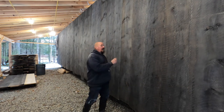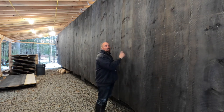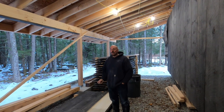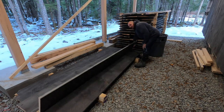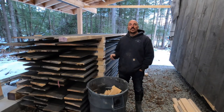After we get the ceiling done in the covered area in the back, we'll add the three-inch battens. If it's a wood product, the most important thing you can possibly do for your siding — to help it last and not cup, warp, break, or split — is to back prime it. I don't know why everyone skips this. Wood is a sponge; it wicks moisture wherever it is, so if it's unsealed it's going to pull moisture in. Here's a board flipped over — this is back primed, sealed on the back side. When you flip it over it has the finish on it. All four sides including the short edge are sealed from the weather.